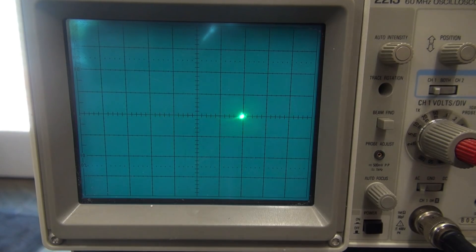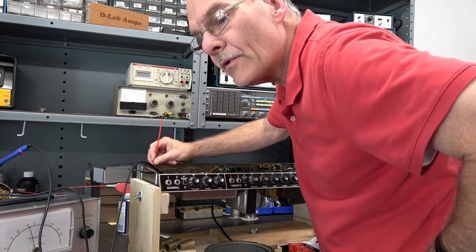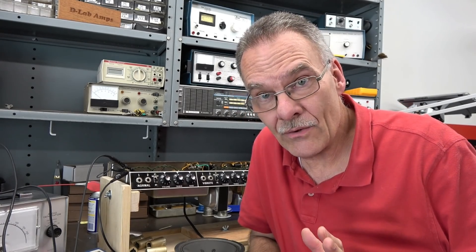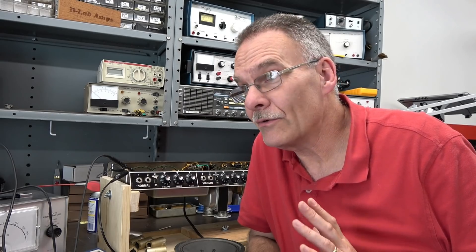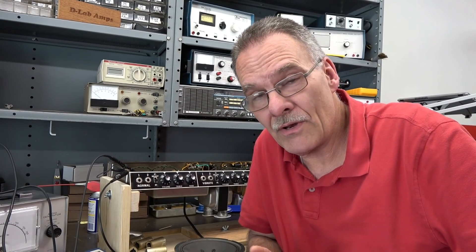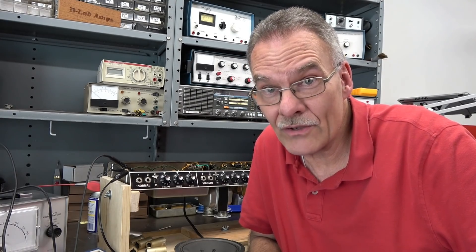There's obviously something else in that circuit — and no, the tremolo's not on. Let me tap around here on the pin sockets. I've tapped around and can't seem to find anything sensitive. The plan was to change out those dual Mallory cathode caps, the little 25 microfarad guys, but I'm not shotgunning — I'm going to change one at a time and see if this problem goes away. It's still dancing around, I've made no improvements. So I'm going to put in the original 0.047 back, since obviously the 0.047 was not causing this problem.